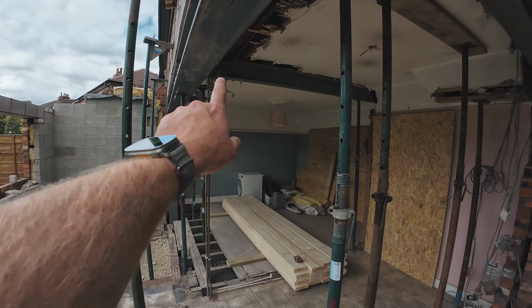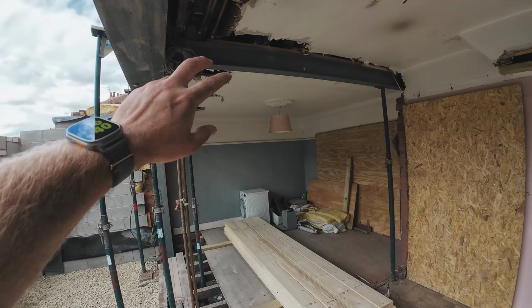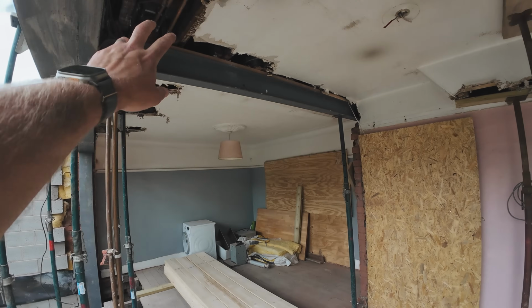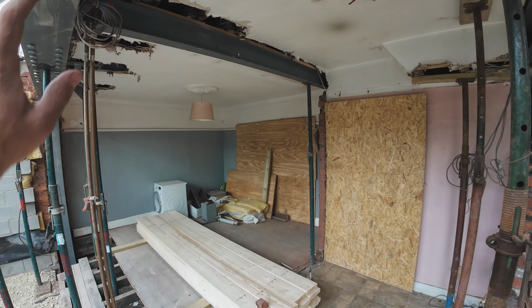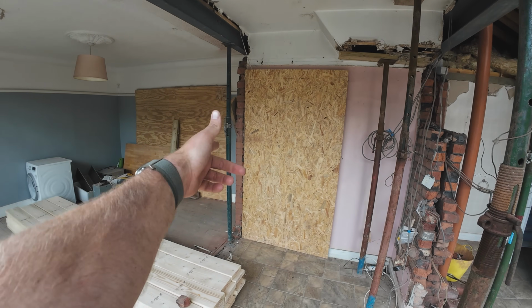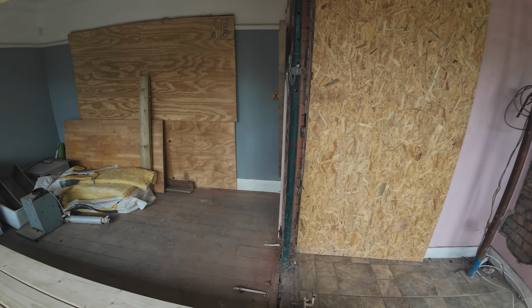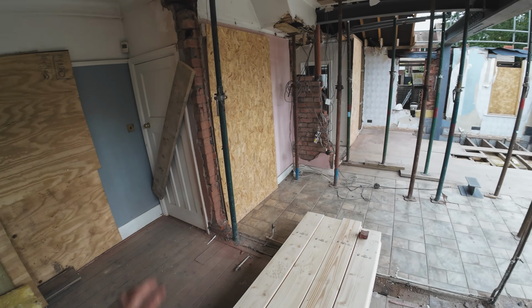And then we've got a nice internal steel here coming up, which is connected to the big steel. And then, as you can see, all the existing floor is sat on it. Then that's all bolted in. Got a pad stone to put here, bit of patching. There's a doorway on the opposite side, which does need bricking up or blocking up. Then that section is complete.